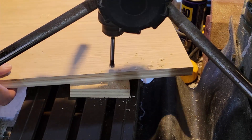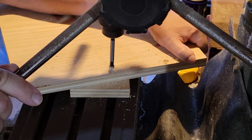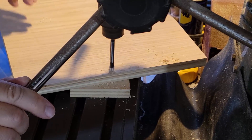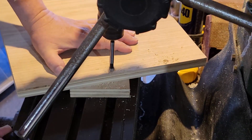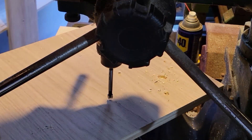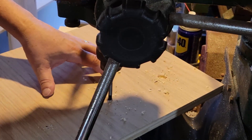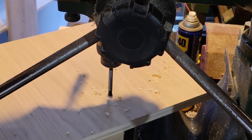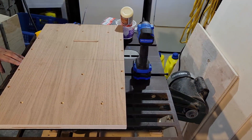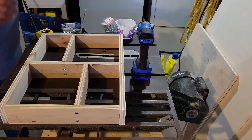Here's what I'm doing: I put the Forstner bit tip down, which just wiggles the board loosely into place, and then I hold it down tightly. There's a clearer clip coming up — it just wiggles a little, then I hold it in place and finish the rest. It's an easy way to make sure things get centered properly, since it's difficult to mark up where everything goes and have it fit on the mill. Then it's the simple part — take the panels off, spread glue, and screw them all into place.